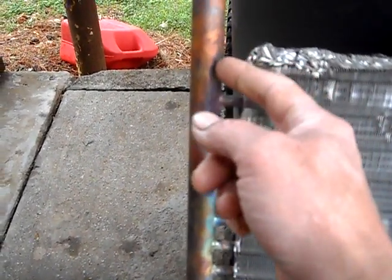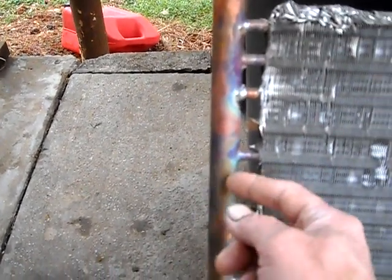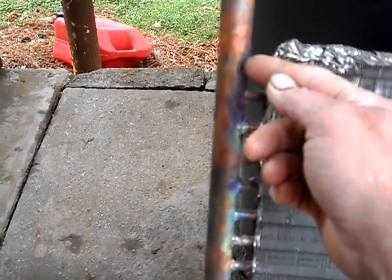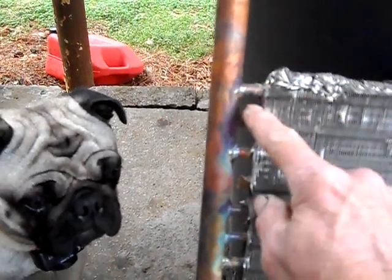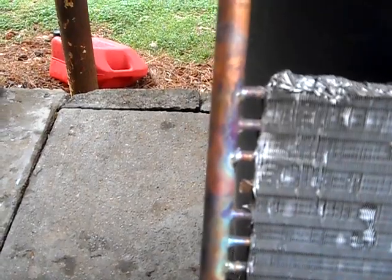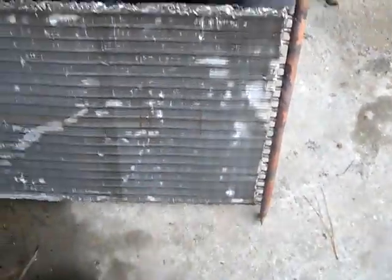I brazed all these things up because I had straight pipe sticking out. Here's a little trick to the way I did it: I marked the center by laying a piece of 3/4-inch pipe on it, then drilled the holes just slightly larger than the tube. I took a nail set and put a dimple in the 3/4-inch pipe with a hammer so my drill bit wouldn't slide around on the tubing. I was able to get the holes made cleanly, and it does not leak. I pressure tested it and there's no leak.